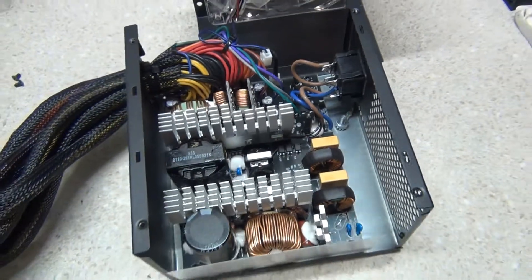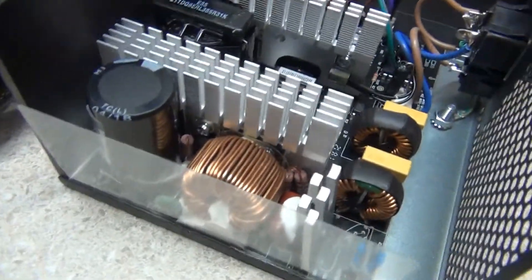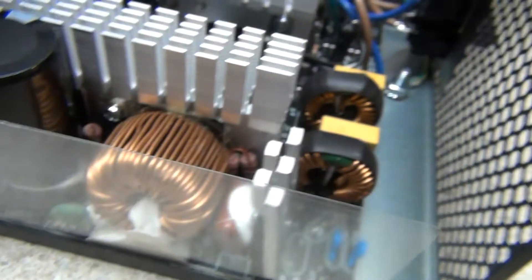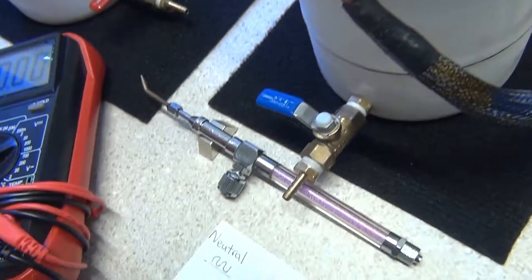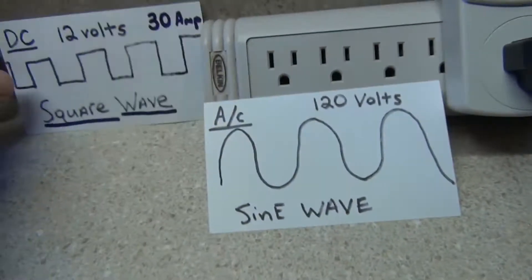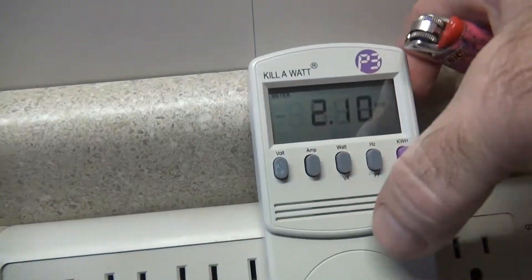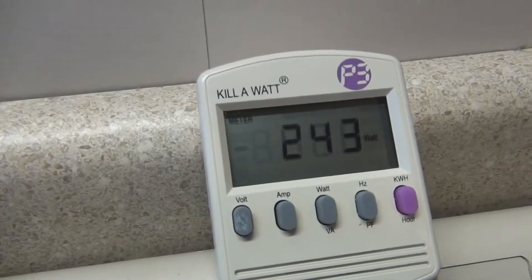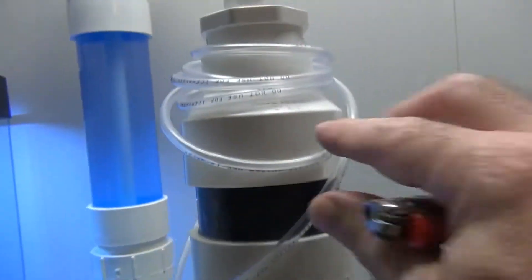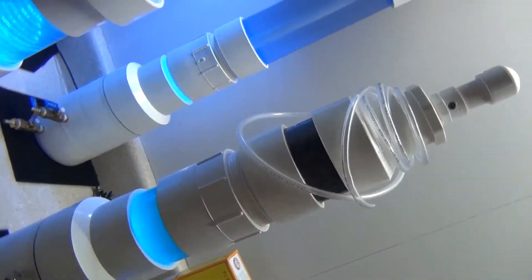This is a computer power supply — it's very efficient, and this is a thousand-watt power supply. Having a really good power supply is crucial to any HHO torch setup. You're gonna have to have an understanding of DC rectification — being able to take an AC power supply and turn it into a DC square wave. At two amps it slowly climbs; the voltage, watts, and gas rate all get faster and faster. I'm gonna go ahead and light this flashback so you can see it — pretty cool!